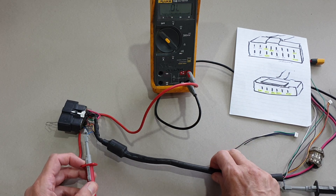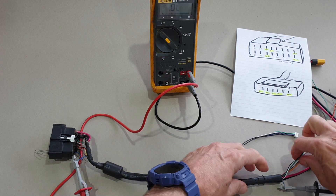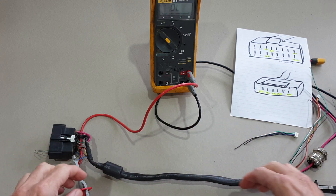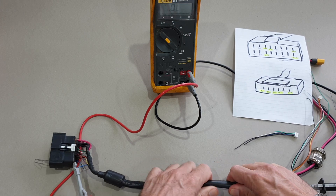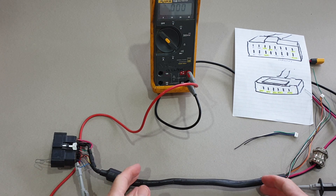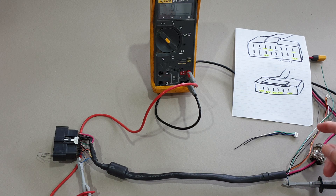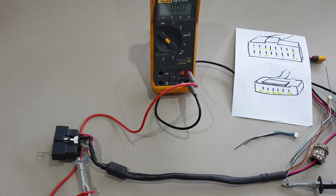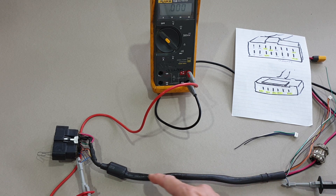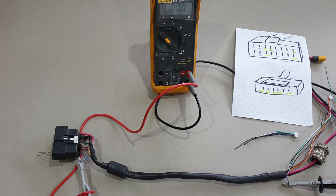Are we getting continuity? No. So I was manipulating the cable, bending them all over the place. You have to be quite physical with the cable — it's not until I really twist it hard that before I was getting full-time connectivity. Everything I tested was fine, and it wasn't until I grabbed the cable and really gave it a good twist. One of the problems with fault tracing in a cable is as you move this piece, these move as well. The result is I've basically got to cut this heat shrink carefully — hopefully it's this side and I can just re-heat-shrink it and put it together. That's basically the fault finding I did to find the fault for error code 16.